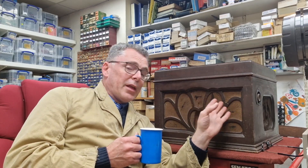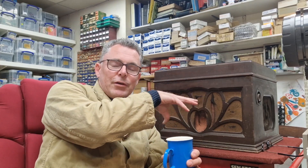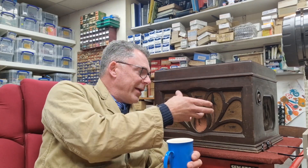So the game plan for this one is I'm going to strip everything out of the cabinet. This is beyond what we normally do here — I've got a company that we send off for full restorations to the cabinets. All this old brown is going to come off, they'll refinish it in French polish, it should look a million dollars when it's finished. So deck out, amplifier out, radio chassis out — take everything out so I can just take a blank empty box down to the cabinet restorers.